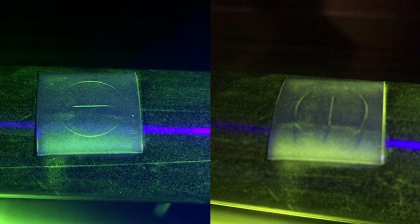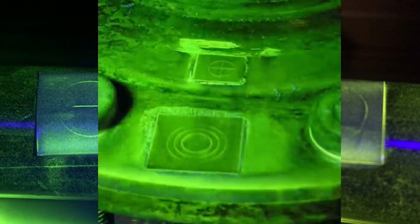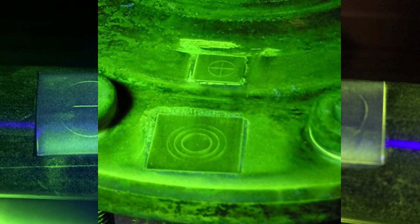So there definitely is a fine line between whether or not you want to use multi-directional units. It typically depends on your part geometry and the volume of testing you're doing, because setting up one of these tests does take a little bit longer, because you have to sit there and balance the field with the QQI and make sure that you're going to see both directions on the QQI. So if your volumes don't dictate it and your part geometry is too complex, you do want to do two shots. But if you can get away with it, multi-directional allows you to do one shot and save a ton of time, because you're going to be able to see the full cross or the concentric circles on the QQI here in one shot.